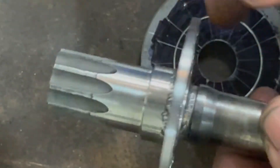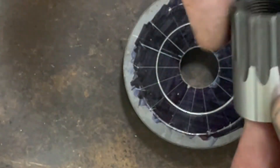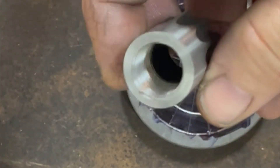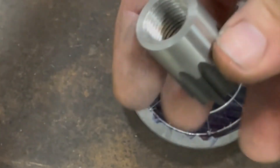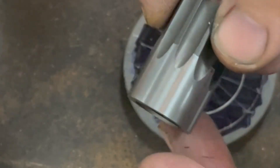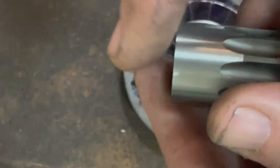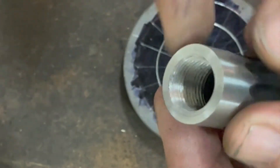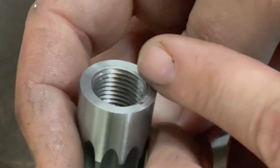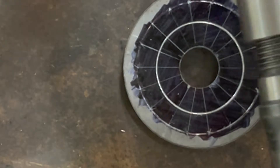I've already made the first side of this flange here in the hub. I can't machine this from scratch — it's just too hard and I don't have a mill. So I used an old bottom bracket I had laying around that was no good anymore. I cut it off with a grinding cutoff wheel because this stuff is pretty hard — it's probably been hardened — then I faced it on the lathe using a carbide bit, and on the inside I put threads to match a random axle I had floating around, which will thread on just to keep it in the right spot.